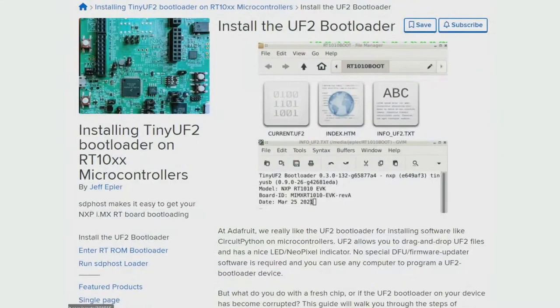We also have a TinyUF2 bootloader. There is a built-in ROM bootloader that is very fast and works quite well. But if you'd like a more user-friendly bootloader, we have a second-stage bootloader built on TinyUSB called TinyUF2. It's drag and drop — you create UF2 files, the same format you might know from our SAMD processor chips and RP2040 chips, for drag-and-drop programming. There's also the ROM bootloader that you can program with a command-line tool available on any OS. You'll need a J-Link to debug, but you don't need one just to program it.